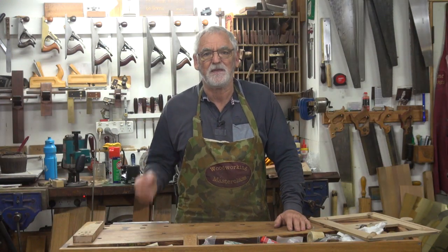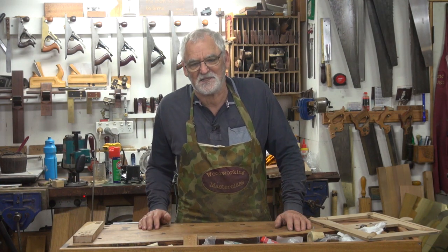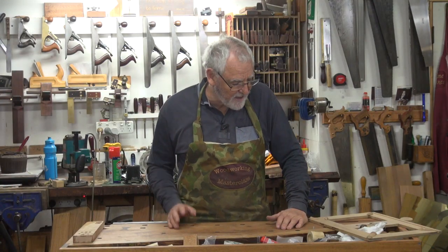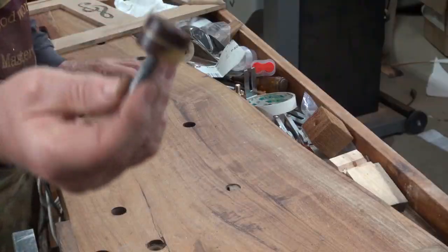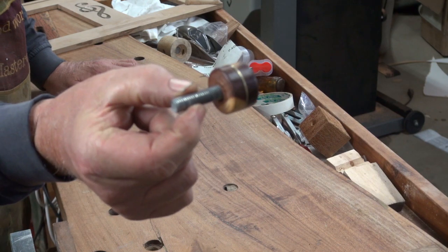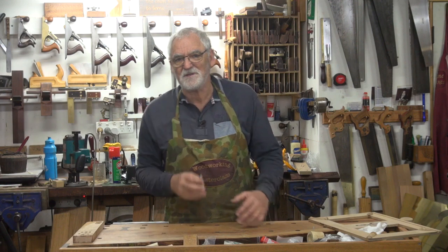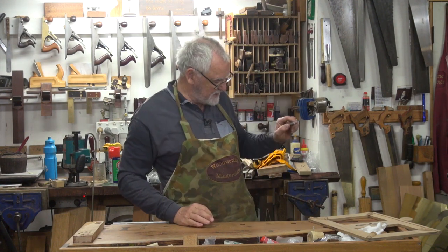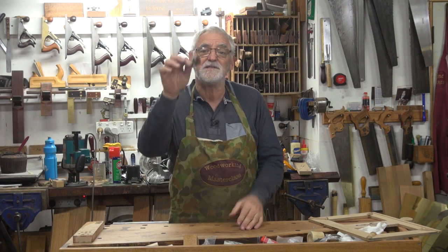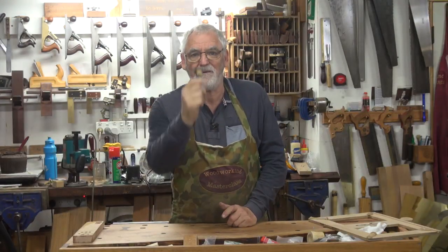When you're tapping, use the coarsest thread possible and do a couple of test taps on the species of timber you want to use it in. But once you understand that, you can do amazing things. Here's the knob that I've made to go onto that music stand, utilising a bolt — I've got a brass insert in there. I want to tap the thread into the neck of that music stand so this bolt will hold. The video up there will show you how I made this bolt.